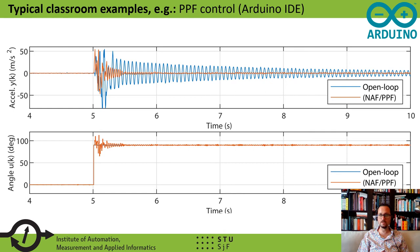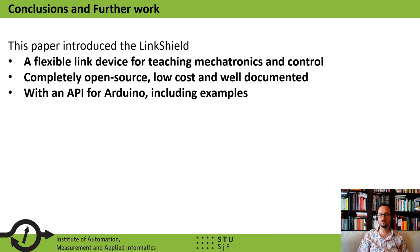Experimental results for this demonstration example are shown in the figure. The blue line denotes the vibration of the end of the beam after a movement to a certain position. The orange line denotes the movement of the beam to this position by using a version of the positive position feedback algorithm. As you can see, this response dies down to its equilibrium much faster than the one without control.